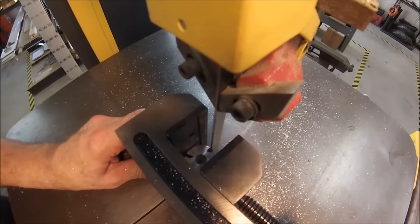If there's any part of the shim protruding on the face of the part, face that off at this time. If you don't have a reamer to fit your part, this is where you bore the finish size. But I do have a reamer, so I'm only going to bore a pilot diameter in the very front to track the reamer straight so that the reamer doesn't follow a drilled hole. I'm looking for 0.500.